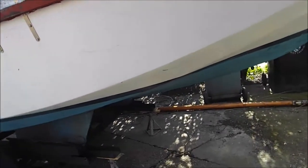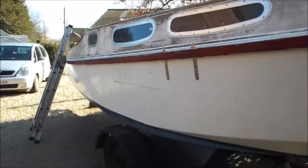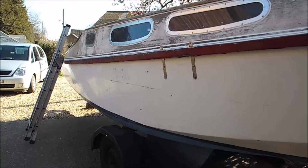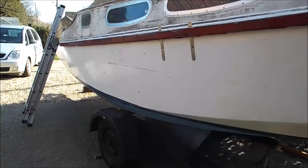I'll just take you for a little walk around the hull. You can see I've done the hull right down there. The anti-fouling on the bottom - the blue bit there - that's already been jet washed and doesn't really need any more sanding because it's quite rough. Anti-fouling is the name boaters use for the stuff you put on the bottom of a boat - it's a paint with chemicals in it that stops marine life wanting to live on the bottom, so it stops a build-up of barnacles and seaweed. I'm not going to put anti-fouling on this because it's only going to go in fresh water.